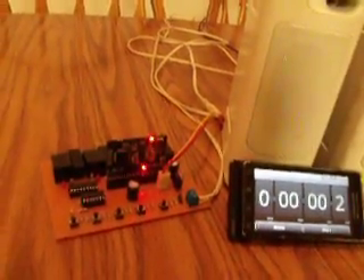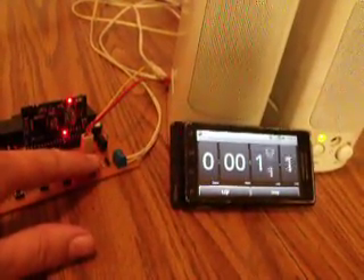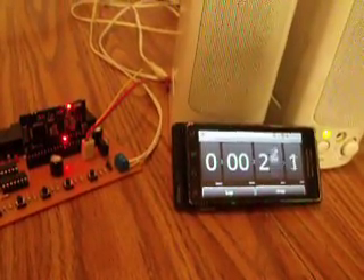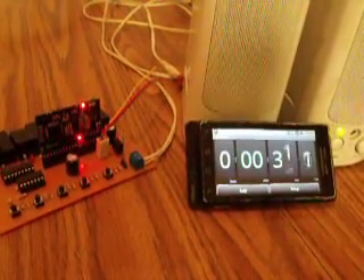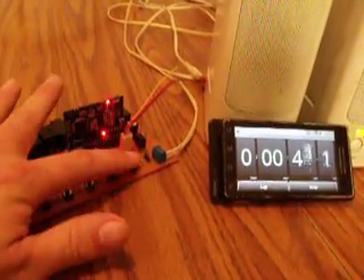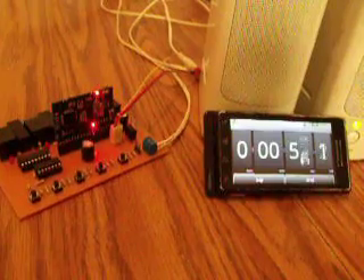I'm going to start the timer just to show you how this works. As you can see, I cannot re-trigger it. This is useful for a lot of reasons — maybe you don't want your prop going off every time somebody walks by. Or maybe you don't want it to trigger at all, and you could just put a jumper between the power and the sense wire and have it go off every 5 or 10 minutes. It will not trigger until that 1 minute time expires. We're up to 45 seconds now and it still won't re-trigger — just sitting here waiting for the timer, and then it will re-trigger once the timer has expired.